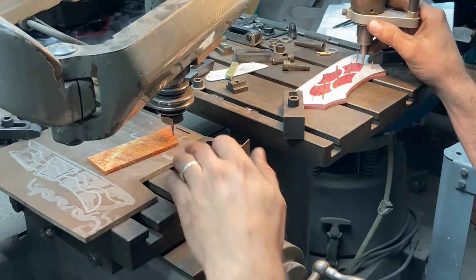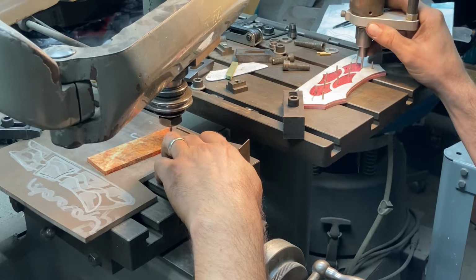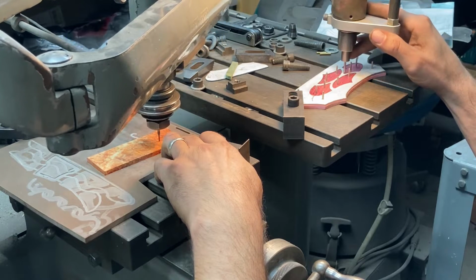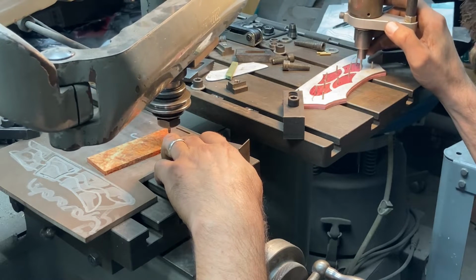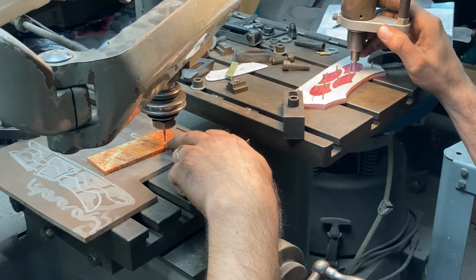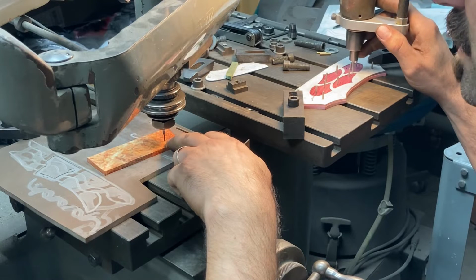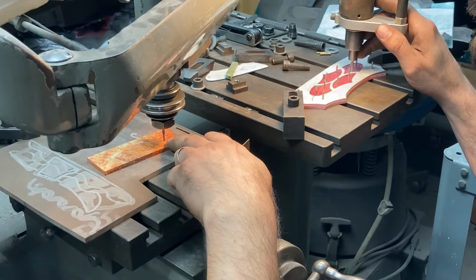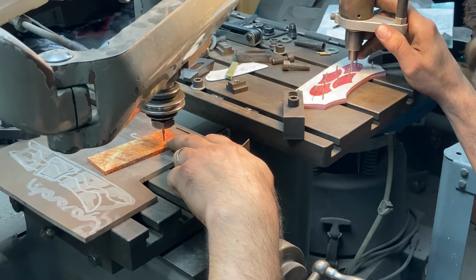so that I can cut the small contours of the pieces here, but also take the least amount of waste possible with this little cutter. But I will be needing to take pretty small passes, 10 to 20 thou a pass, while vacuuming it as I go to clear swarf, just to be careful and preserve that little cutter.